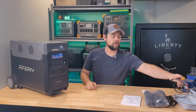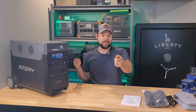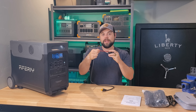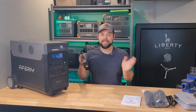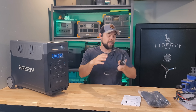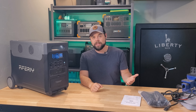One nice thing is they include the solar charger — you'd be surprised how many companies no longer include that adapter. It uses an XT90 connector rated up to 90 amps. MC4 connectors are only rated to 30 amps, and the 12-gauge cable is only rated to about 25 amps, so the included adapter is fully capable of handling all 20 amps of solar input without issues. They also include a standard wall charger — just a C13 plug, nothing extra needed. If you want to maximize input, I'd use four 450-watt panels for up to 1,800 watts, or 10 to 12 200-watt panels for a more portable system.